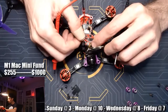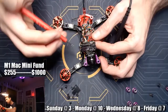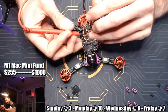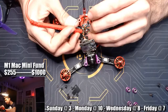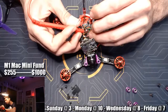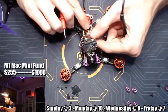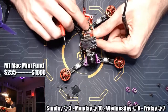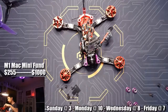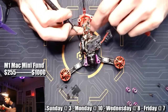Okay. What other positive and negative pads do we have here? Down here we've got two more sets. We've got the ones that are going to the 5-volt BEC, and then we've got another set that are going somewhere else. And I'm not getting continuity anywhere. So the first thing that we checked was going to the receiver.